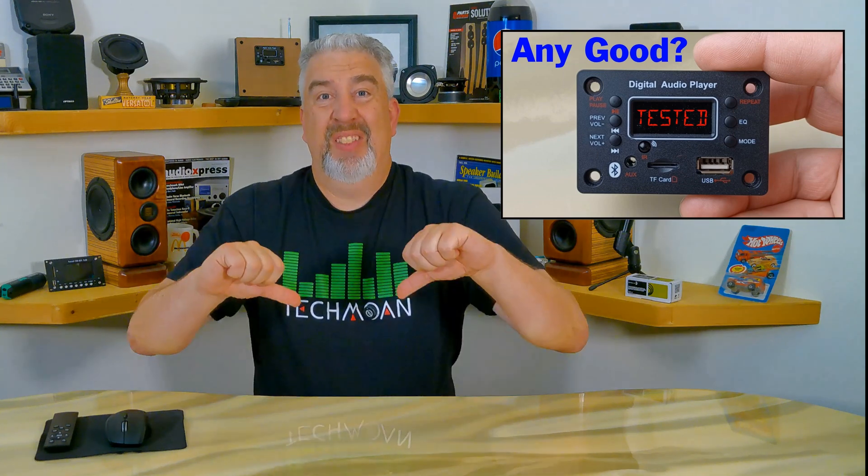Here's where I kind of goofed. A few videos ago I reviewed this little all-in-one music player and amplifier, and I gave it a thumbs down because of noise — it wasn't great all around. But since I already had it and during testing it seemed to work fine with the setup, I made a little face plate to mount it in and went with it. No bueno — this thing let me down. I tried it out for several hours at home — a couple hours downstairs, an hour or two upstairs. It worked fine, had good battery life. But when I got it to our field day at school, after about 20 minutes or so, it started cutting out — every second or so, just for a split second. And that's no good.